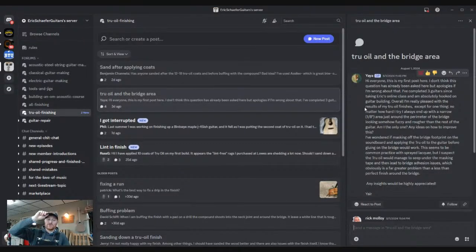One is make sure you're easing the edges of the bridge so you don't have, especially those wings, kind of 90-degree corners. Make sure those you've eased off with 220 or 320 grit so they're essentially deburred and not sharp before you get to the finishing process. You're going to tear fewer fibers off your cloth. Even if it is a truly lint-free cloth, you can still create lint out of it by rubbing it vigorously into a sharp edge. It's going to tear the fibers and create lint.